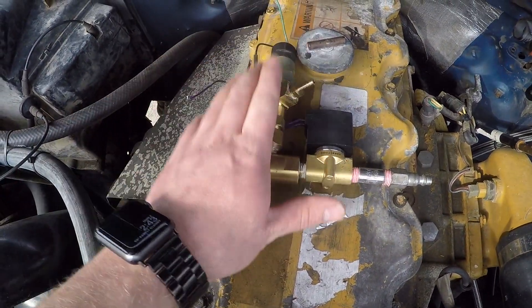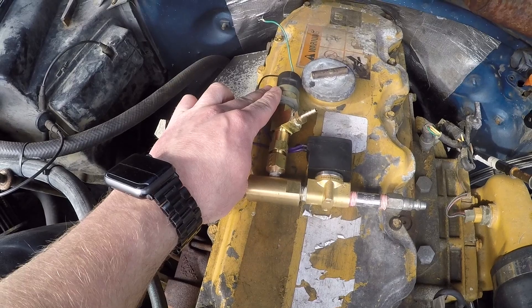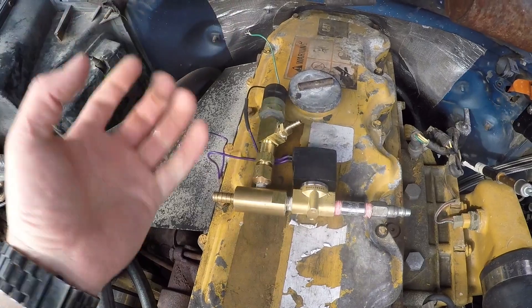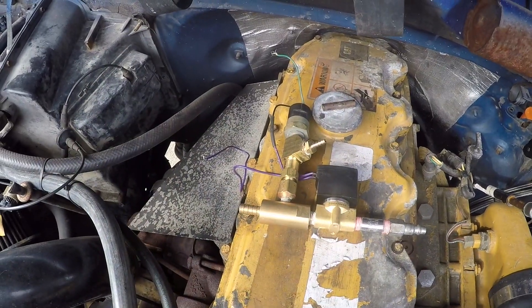Basically, when you turn on the heating system, it will send power to this vacuum pressure switch, and if it needs vacuum it will close. It'll open this valve, which will send air through and suck all the air out of the system. There's a check valve so it can't bleed back once everything shuts off.